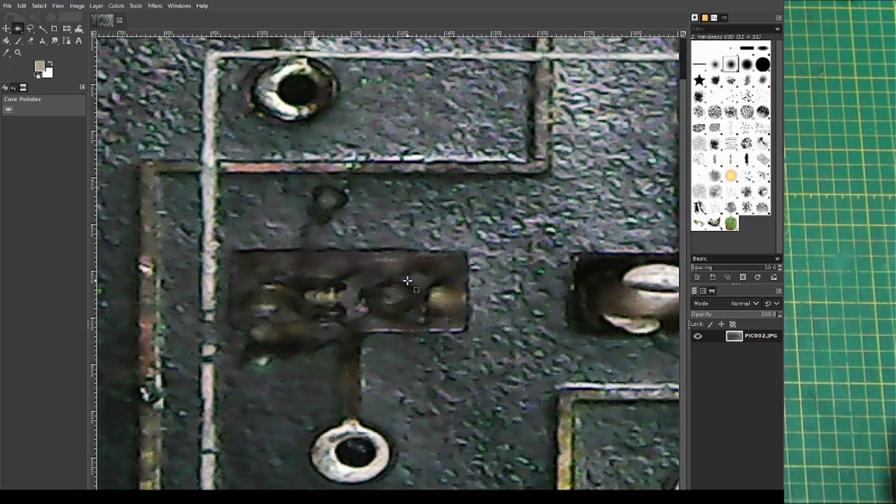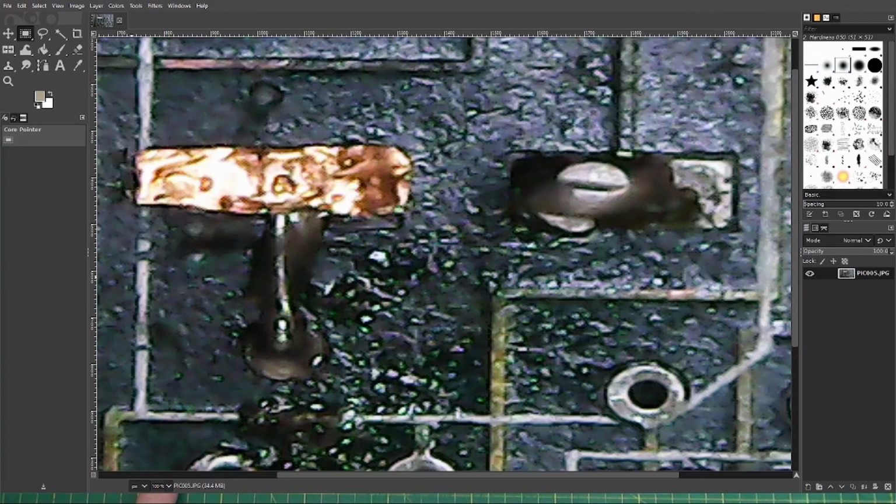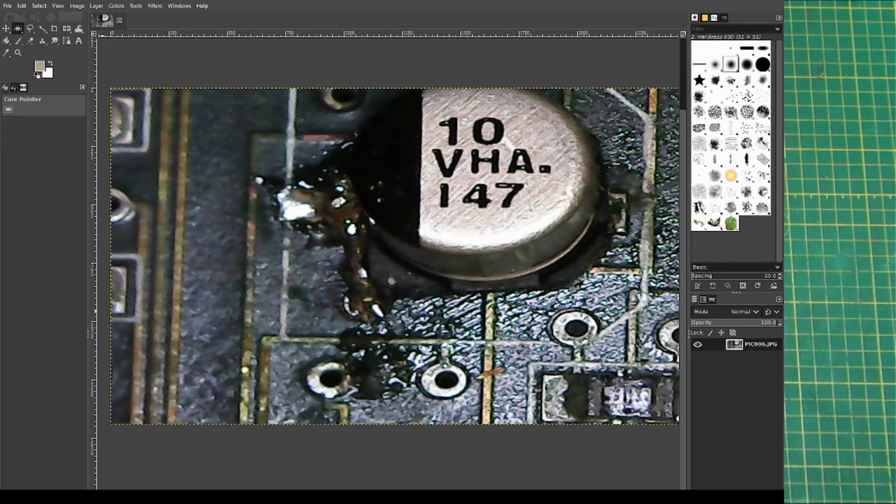Anyhow, I messed around with that for a while, and I managed to cut a little tiny piece of copper foil, and a little wire going through the via, soldered it in and got it onto this. There's another piece of foil underneath there. Well, it's attached to this one to make it. And after all that was done, I got it soldered on there. The caps on there. And I tested it out, and it does go to where it's supposed to go to. So, took care of that part. That was fun.